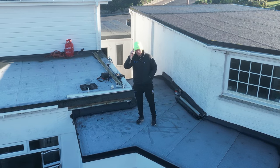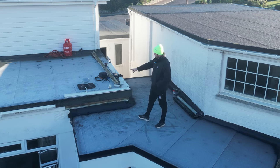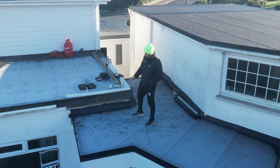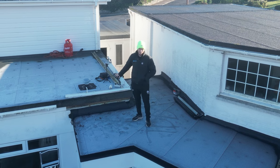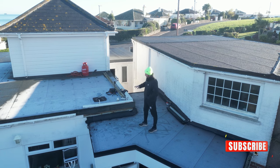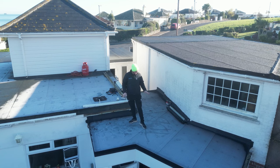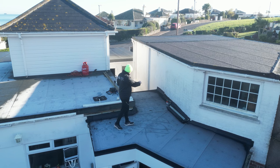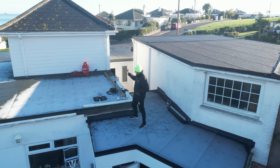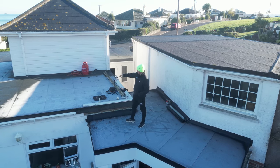We're back at the warm roof project — very chilly this morning, Scan Safety hat and thermal waterproof gloves on. I've just taken off the existing fascia on the returns. All that's to do is the upstand: we're going to put a lead upstand down and behind the fascia, then reinstate the fascia and gutter back in — fully waterproof sealed roof. There's about four to five inches of upstand. Ollie's coming about 12 o'clock to crack on. Also installed the mushroom vent last night — it was dark so content was minimal, apologies for that.